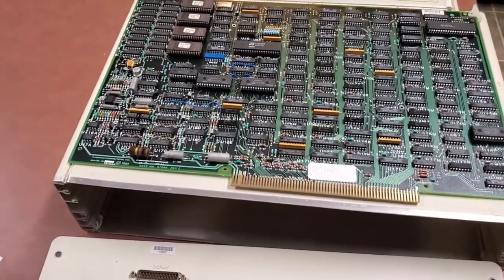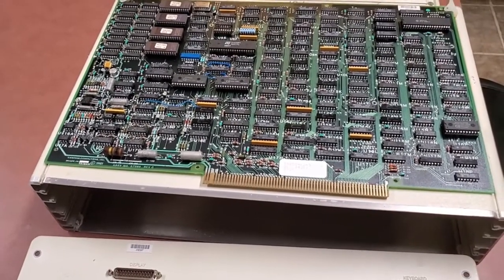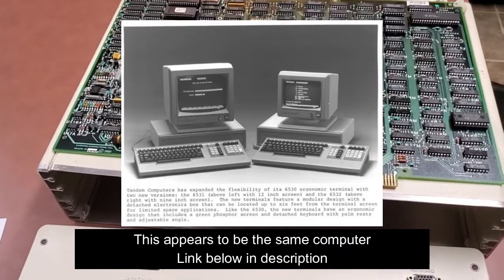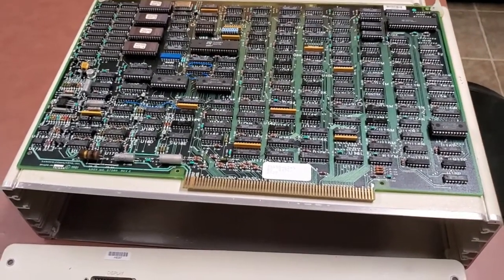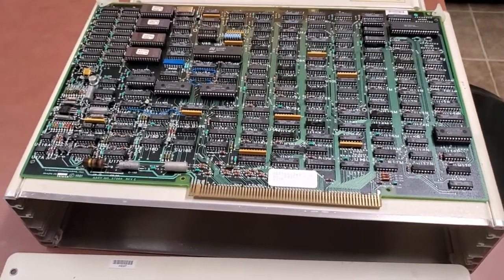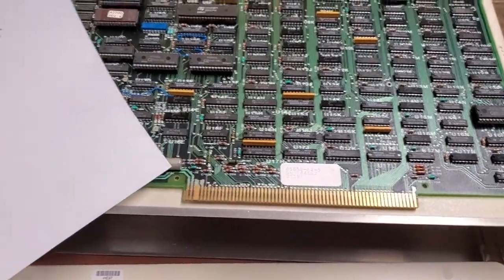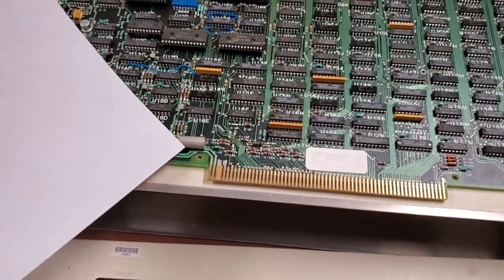I haven't found much on the internet, but I did find one advertisement for some terminal monitors. For a big mainframe system it had a picture of a giant computer behind it with this sitting under it, but most of the other pictures I found, the monitors didn't have something under them. So I don't know exactly what it is. This capacitor right here is for the five volts and it is shorted, so I need to replace it first.